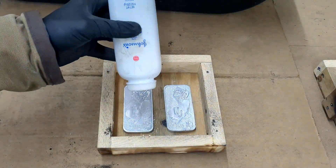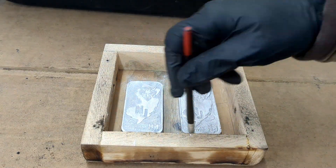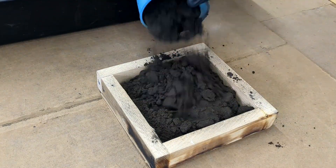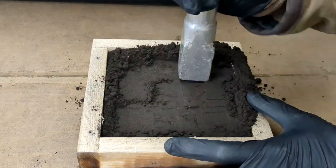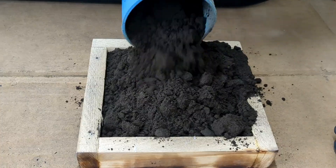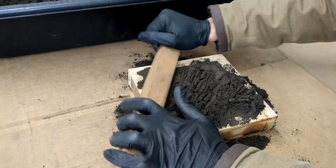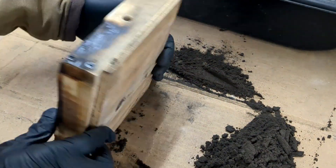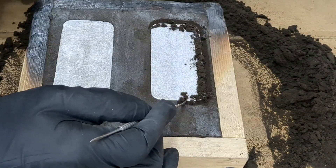I'm going to be making more of these New Jersey Devil aluminum rectangular bars. Let me go through the process of sand casting. You first put the part into the mold box, sprinkle some talcum powder on top — this is so the sand does not stick. Then you continue adding more foundry sand to the mold box, compacting it tight, then scrape off the top and put a flat surface on the back, and flip it over.